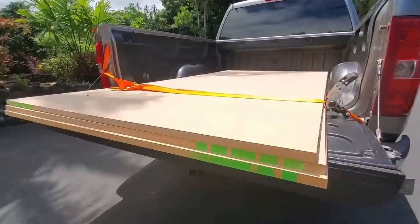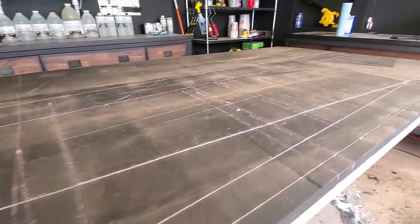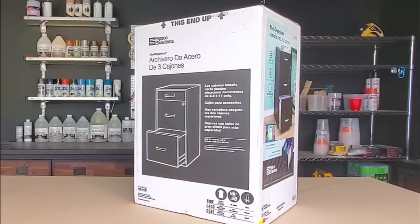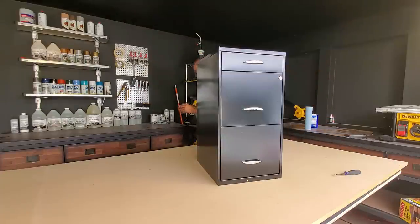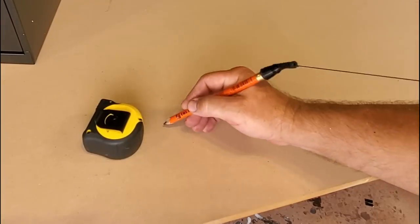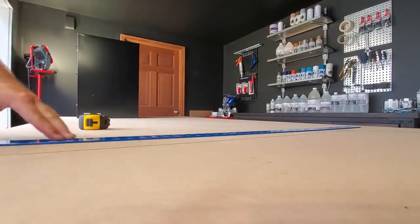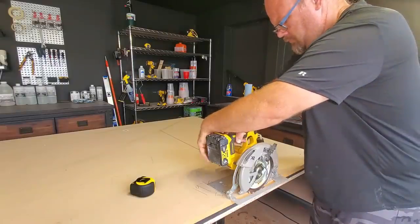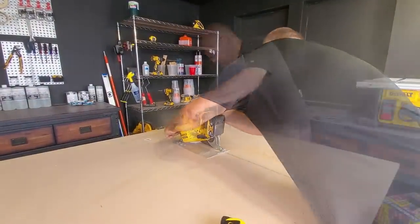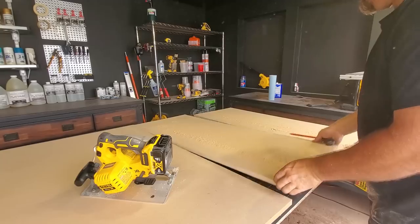Time to dive into this project. First thing we need is substrate — something to build our countertop out of. I'm going to lay down some foam and I have MDF, that's medium density fiberboard, and that's what we're going to cut to size. I got a filing cabinet because this is where my kids are going to store their books, so I'm going to measure it to get a depth for our desktop. I like to extend the edge by one and a half inches, so it's a total of 19 and a half inches deep. I'm going to use my T-square and a simple skill saw to cut this to size, then do a rock face edge — this gives me forgiveness so I don't have to cut perfectly straight lines.